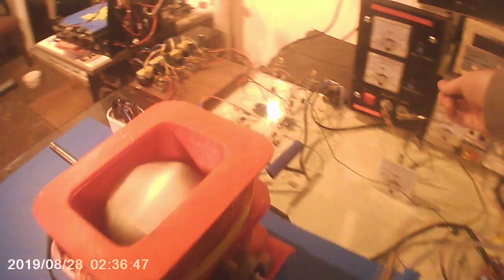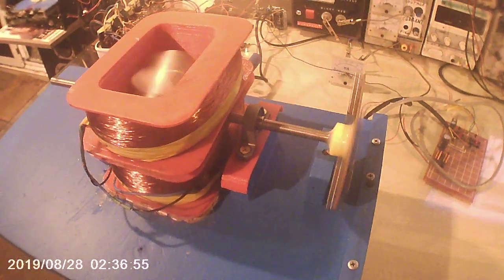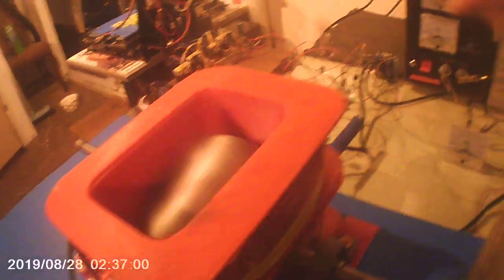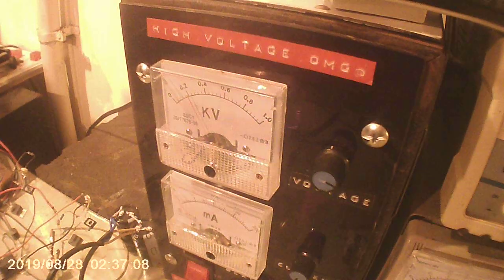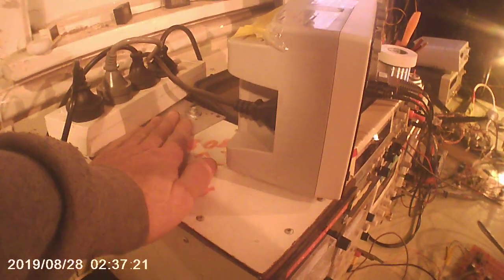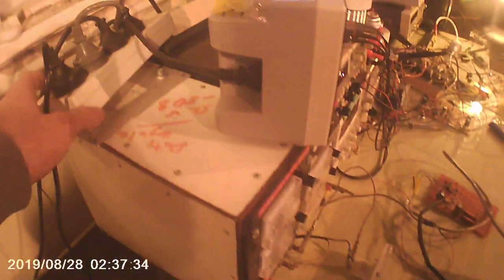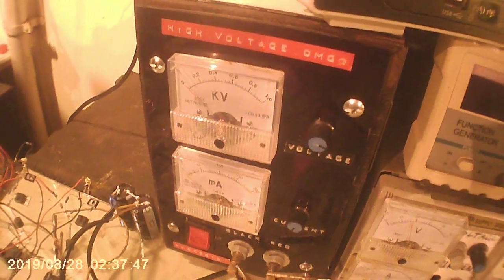It doesn't sound good — it's making bad noises. I have no idea whether this is possible or not. It appears the voltage output just started dropping and the load wasn't going up. I suspect the modifications I've made to my power supply have made it more fragile than it should otherwise have been, and it is hot — it is actually very, very hot. The transistors at the back — oh yes, ow — I could not even get close to holding my hand on there. Okay, checkmate. But at least the motor is back up and running. I might have to wait for this to cool down and maybe add some more heat sinking and try again.